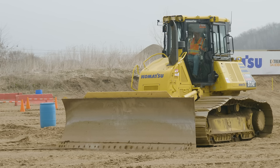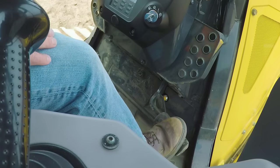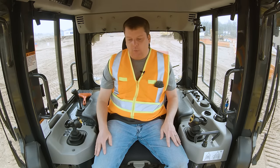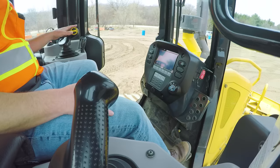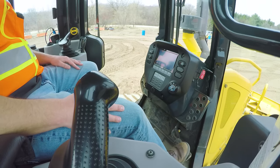For safety, I like to go over safety devices first. After the lock, seatbelt, and lock levers, you've got the decelerator pedal — that's my right foot pedal. It's basically an engine clutch; it brings the engine down to idle, and that's what's going to stop this machine at any point. That's why I always recommend using it any time you're shifting or before you engage the safety lock levers — it's kind of a fail-safe.